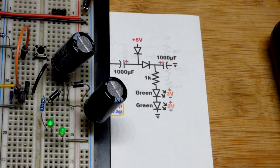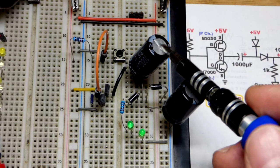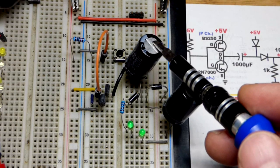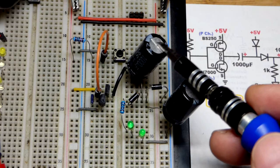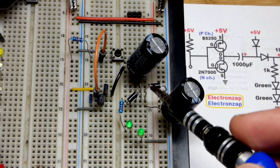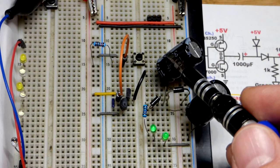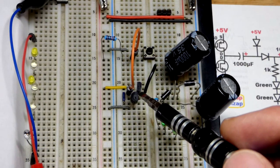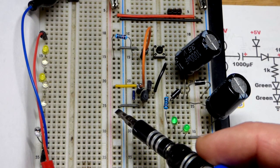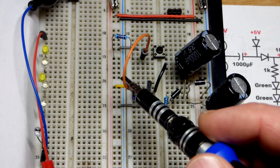The voltage is going to quickly go down as well. This is the charge pump capacitor — we charge it and then we put it in series with the power supply so that it pumps that extra voltage somewhere else. The cathode is right there, so it can charge that way if the negative side of the capacitor is connected to ground. We have a couple of transistors here — it's either connected to ground through that transistor or to the positive supply through the other transistor.